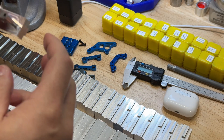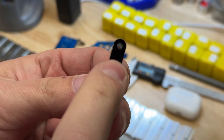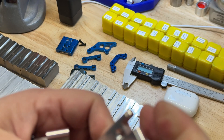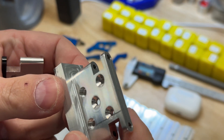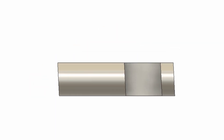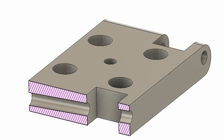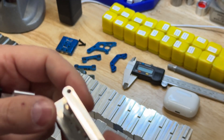You may or may not notice that on this first early prototype, the holes are right in the middle on the front and the back. But if you look at the back side of this one, you can see that the holes are offset, and that's because these slots are actually angled. This whole thing has an extra three degrees, so the holes don't run co-linear to the body — they actually run at a three degree angle to modify the performance.